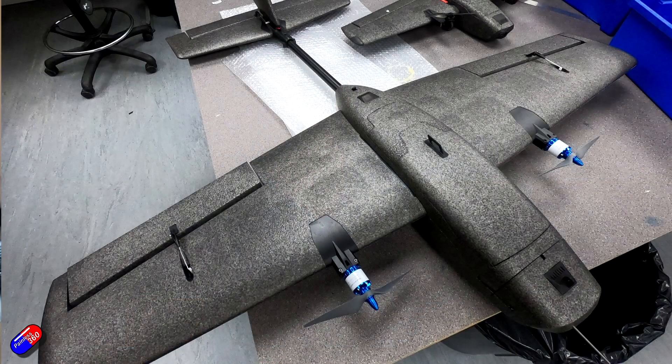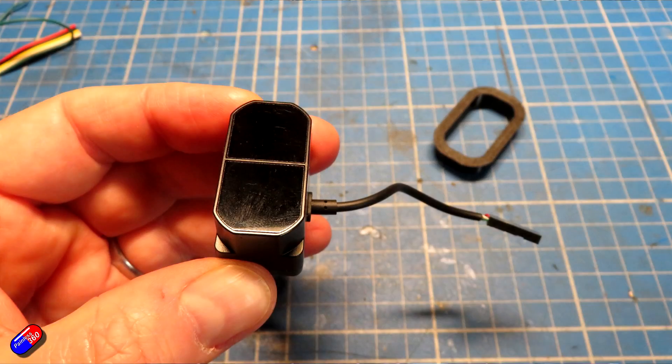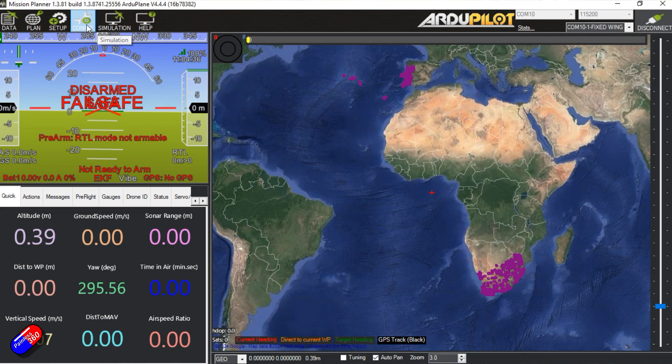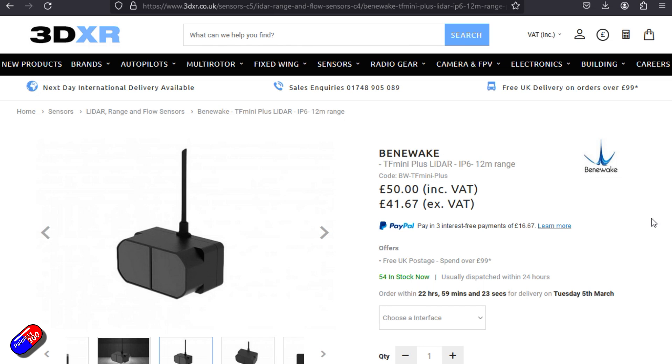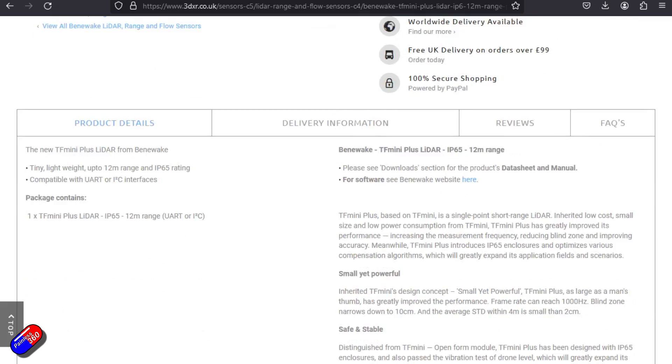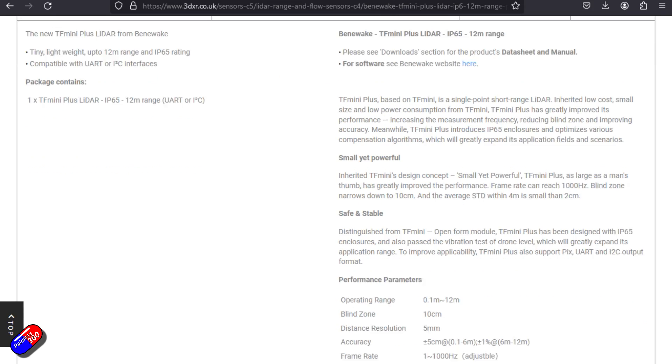The T-Wing T2 is a big enough model to allow us to install a Benewake Mini rangefinder in the belly and set everything up — we've just been waiting for decent weather. This video focuses on how to set up the autopilot and configure the rangefinder. The rangefinder we're using is a really nice one, about £50 — I'll put a link below — but you really need a rangefinder and an airspeed sensor for the autopilot to do a really good job of automated landing. Let me hand over to Ben.